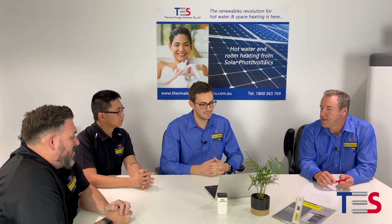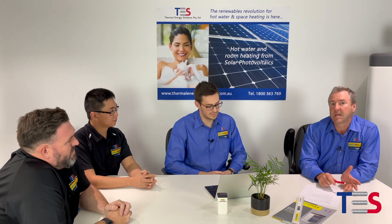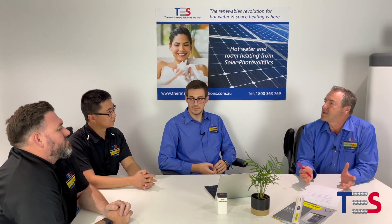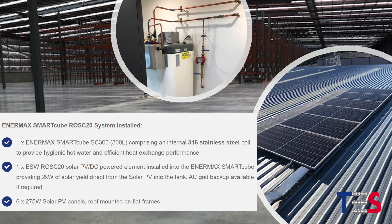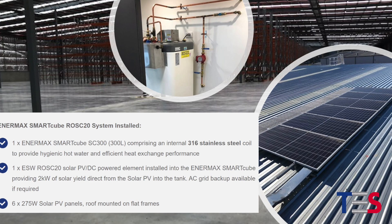I'll pass now to Peter Teo, our senior engineer, who's involved in our project design work from residential applications all the way through to the very largest commercial and industrial applications. Warehouses are a very popular application. What we do is put satellite hot water plants near to the point of use. Traditionally you would need to run long services to the point of use, but these tanks can be placed near the water outlet and all you need to do is run DC cable up to the roof with PV panels.